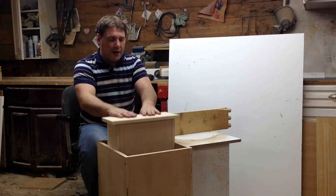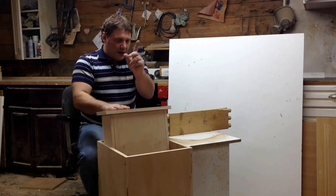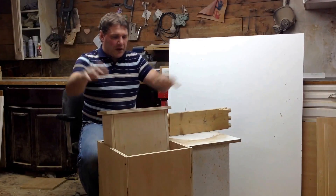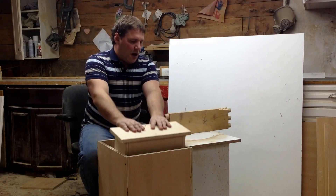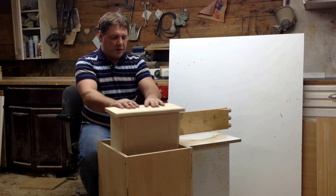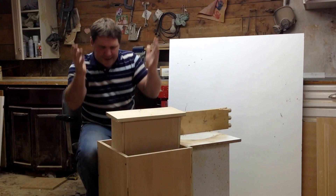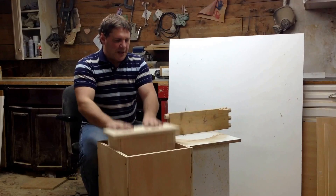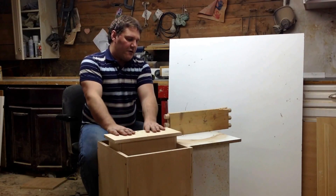Right now I just have my center box done but I'm extremely happy with it. Like I said in the other video, it's going to give me a bigger range of motion than my big floating router — about six inches by about a foot. So I'll be able to comfortably route on the end of a six-inch by one-foot chunk of wood. One of my springs came unhooked here, I just got to spend a minute and get my springs hooked up, but you can see it gives me a nice range of motion especially in the center.